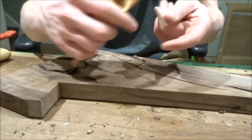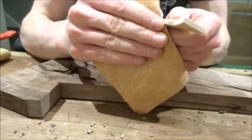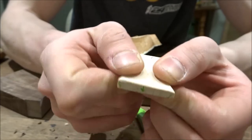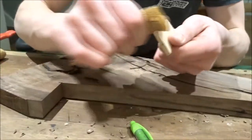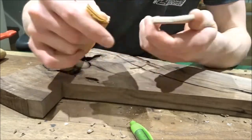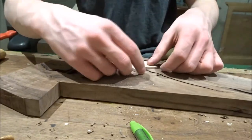Now you have the bow tie, and to make it fit in the recess just snug, what you're going to want to do is taper the edges. I've shown you right here by drawing the pen marks — the down-facing side has two corners shaved off it. You can do this with a knife or sandpaper. I just used sandpaper and sanded it down pretty good.